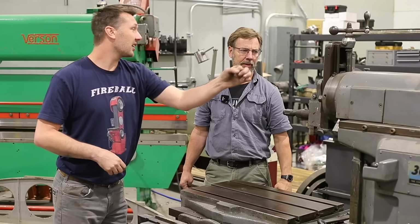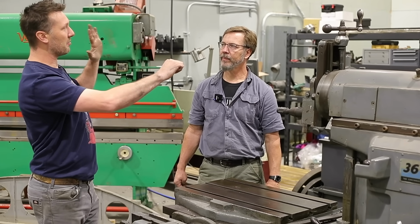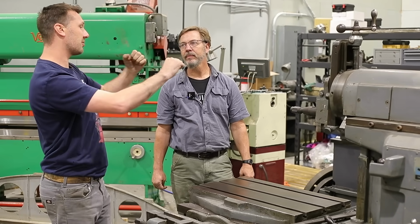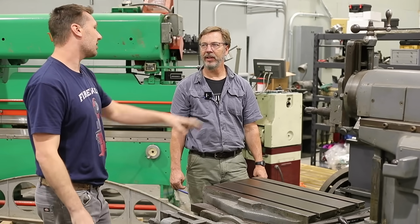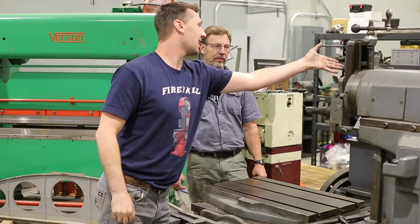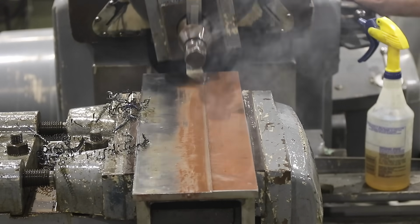It's a drag link. It's basically a drag rod, a friction bushing on the side of the machine. When it's coming back, that rod's trying to push and it levers and pushes it back because there's drag. And when it's going forward, it's drag, and it slams it shut. So it's just a drag link is all it is. It's not rocket science. Even you could make something like that. The complexity is when you start tilting the head, it also needs to have some movement and flexibility to follow. I just need the time to do it, and that's the commodity around here that's short.